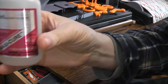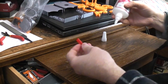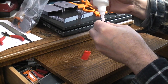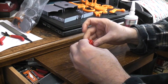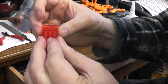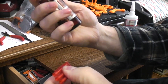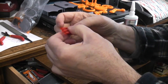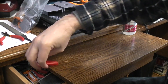What we're going to do is glue the back of the gun barrel onto this support, so in the end you get one piece. It's easy to design that as one piece, but you would need supports if you did that. I'm going to use standard Maxicure — extra thick — put a few drops down there, center it and push it all the way back on. If you're impatient, take your speed set and give it a shot.